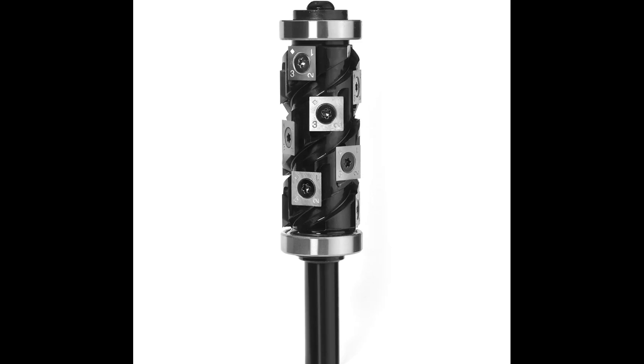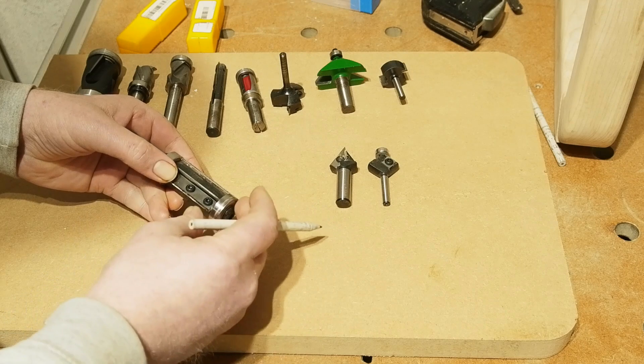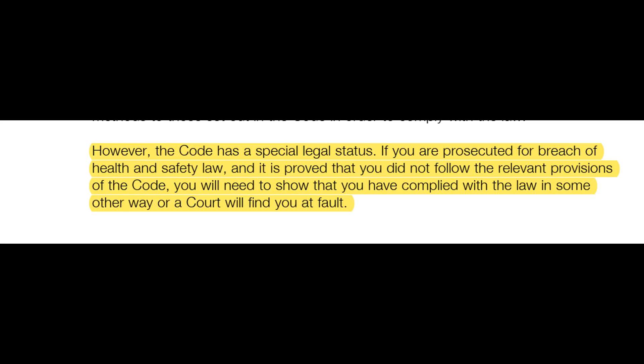Sometimes rather than a solid cylindrical body, a limiter will be designed into a cutter. The top image shows something like you might see on an old spindle moulder — essentially a backward-facing blade before the cutting edge, not ideal but still a limiter preventing horrific damage. Sometimes a limiter is a raised section before the blade, not uncommon on many router bits. The same goes for a non-round cutter — it will still feature a raised part of the body. This large Trend chamfer bit I have is a good example of that.